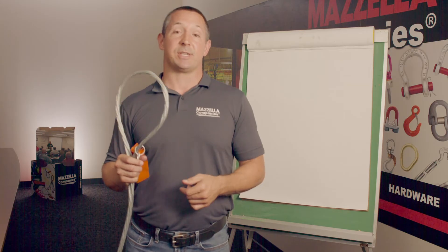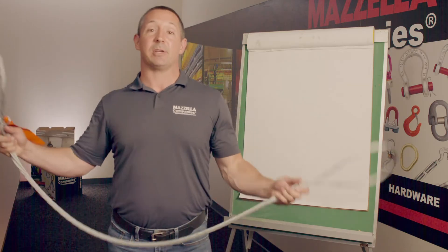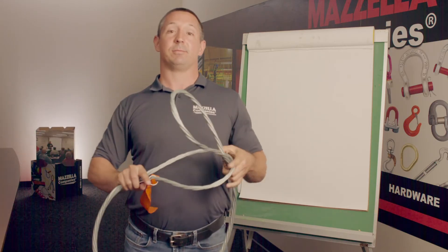Really, Taz, it has to come down to the d-to-d ratio. We can send you additional information because while you're asking specifically about wire rope, that's one of the key advantages of the seven-part sling — that d-to-d ratio. When you've got the component wire of a seven-part wire rope sling with that d-to-d ratio, you do not need to have such large hardware or shackles.